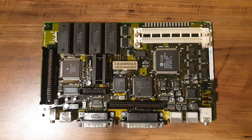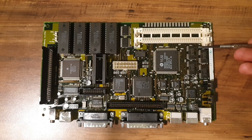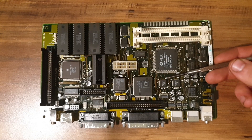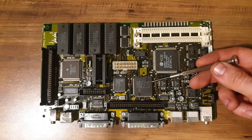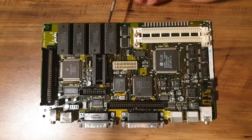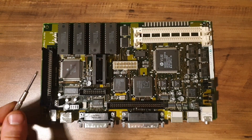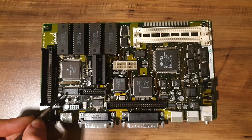Here's a close-up of the Classic 2's motherboard — it is tiny! Up here we have the 30-pin SIMM RAM slots, upgradeable to 10MB, the integrated 2MB of RAM, audio codec chip, RS422 serial chips, VLSI chip for handling the system bus, AMD SCSI controller, 512KB of ROM containing the system BIOS, system tools, and even a little hidden gem. Then we have the Motorola 68030 CPU running at 16MHz, but with that 16-bit data path. Below is a small microcontroller that runs the ADB port.